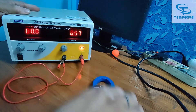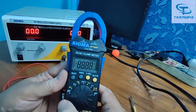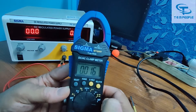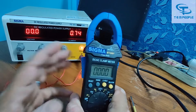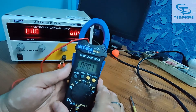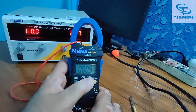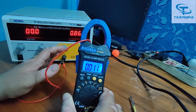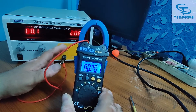Here it is — you can see around 0.5 ampere current is flowing initially. On the clamp meter you can see the DC sign. There is some zero error, so I press the relative button and the zero error is gone. The instrument is ready for use. Taking the clamp wire onto the positive terminal, and reading around 1.5 to 1.6 ampere — it cannot read in milliampere.